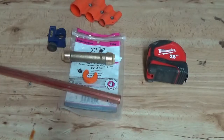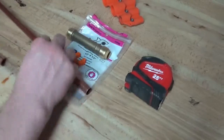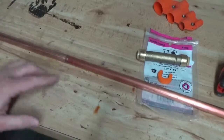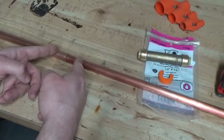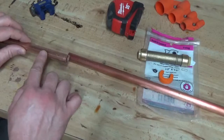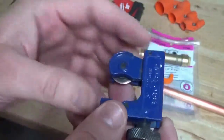Here's how you do this — you'll get more real-world experience when I show the footage of me doing it at the end. Basically, you're going to have your pipe failure somewhere along the length of pipe, and then you're going to make cuts on either side to total a two-inch spread between the two cut points. For the sake of this demo, I'm cutting one pipe to show how it works. For this particular cutter, you'll see there's a bed of two little bearings, and then you have the actual cutting mechanism.